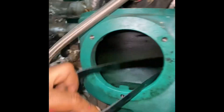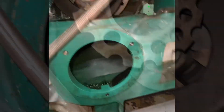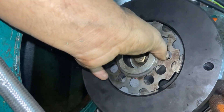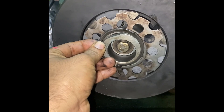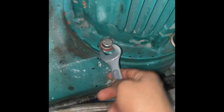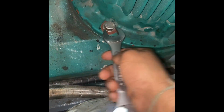First of all, I stopped the purifier, shut the inlet, and shut the steam, waiting until the purifier came to a standstill. Afterward, I turned off the power. For safety precaution, I performed lockout/tagout, and then the replacement was carried out.